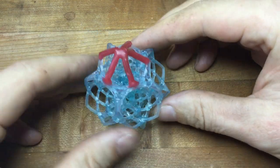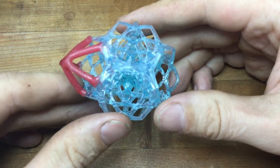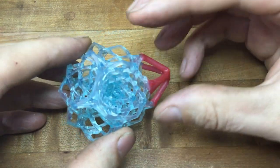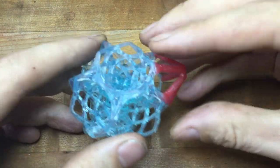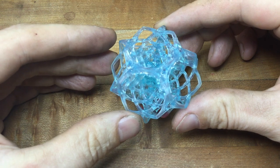The nice part about spruing with fractals is that generally they have their entire sprue system built in. You're just trying to contact a certain set of vertices. So we're coming in on this standard five-point set and then converging our sprue to a single base, and it will be sprued in one point.